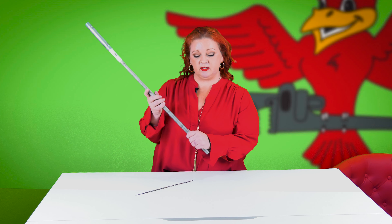If you don't maintain these and you don't replace them as often as they should be, they disappear — and this is what's left. When that water has nothing else to eat, it goes after your water heater tank. So it's really important if you want to maintain the lifespan of your water heater to make sure it lasts as long as it possibly can.